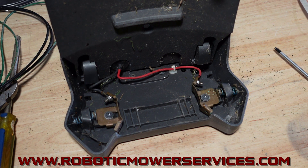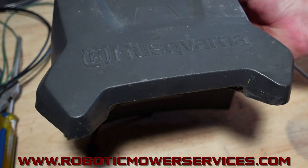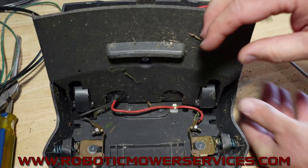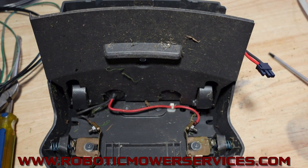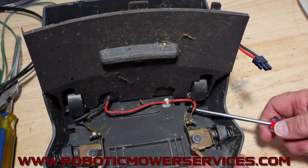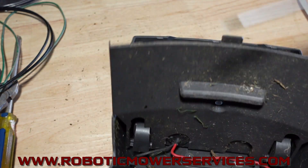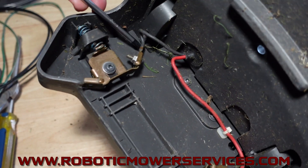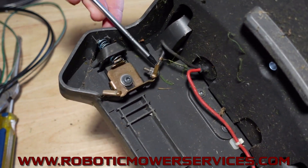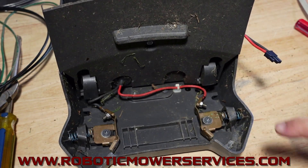Real simple thing to check. With this mounted on the charging station, this is the way it would look — your mower comes in here, this is where it parks. Reach up under there and feel around for your positive wire and your negative wire. If either one of them moves — like you see this one here move up and down freely, and over here the negative black one moves up and down, the whole screw rotates everything — that is a problem. It should not move. That is a bad connection.